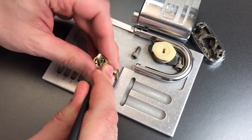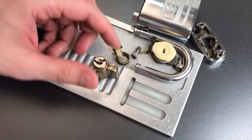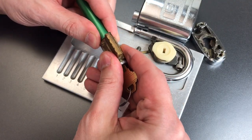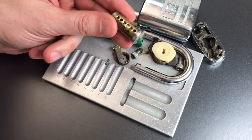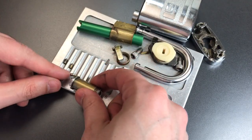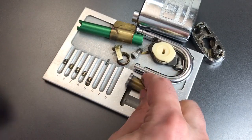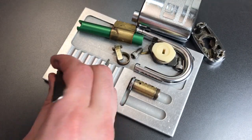But we are not here to critique the padlock — we are here to see what's in this really well-done challenge lock. So let's get the back piece off. Now we need a key and the follower. Let's start dumping these key pins out: standard in one, homemade serrated in two, homemade spooled in three, homemade spooled in four, standard in five, and looks like a single serration on number six.